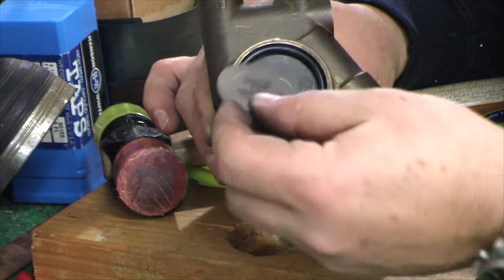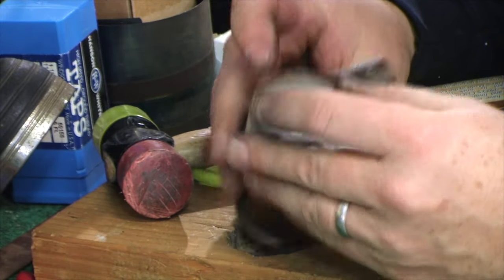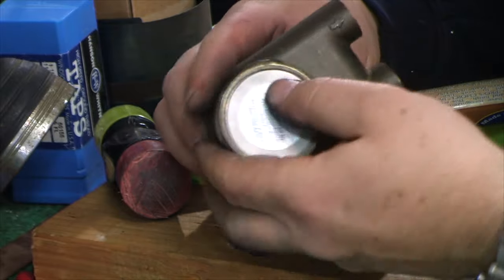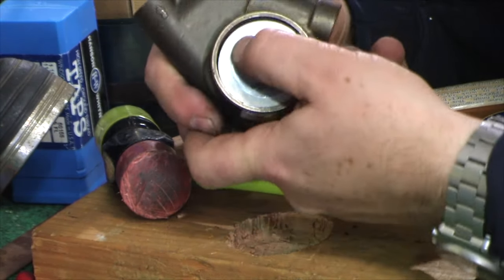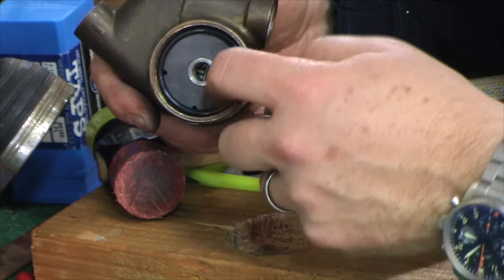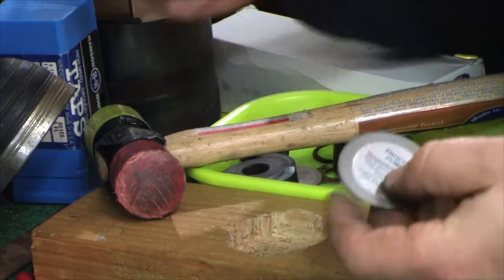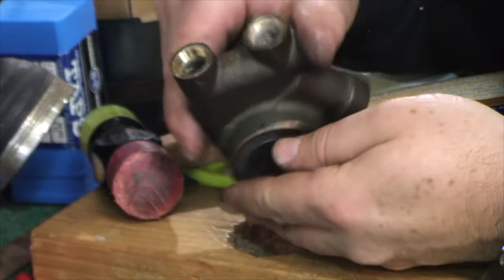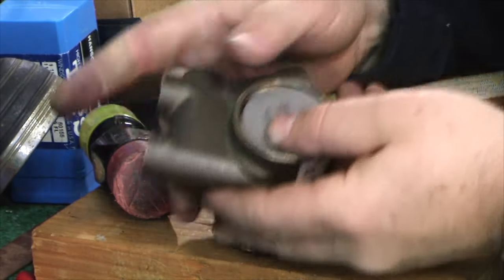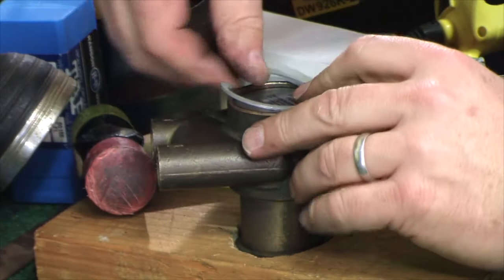Then the new cover plate — stick it around obviously. This is a little tricky because when you push this in you've got to make sure that the O-ring compresses into the groove and gets into this area real tight. I'm going to use the new one because it's nice and shiny and clean. At this point you'll want to get your snap ring pliers and snap this back together.